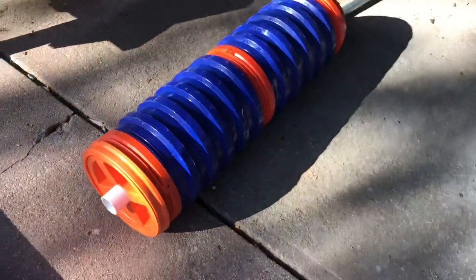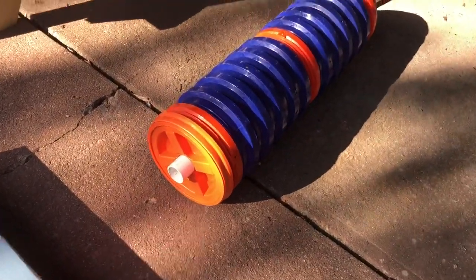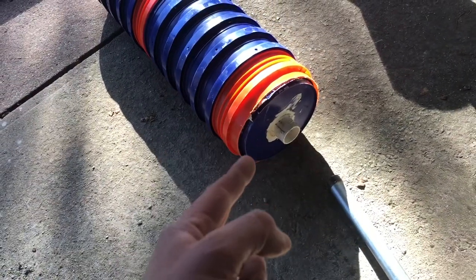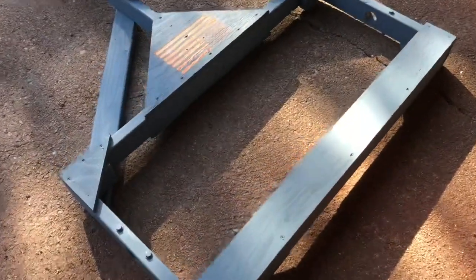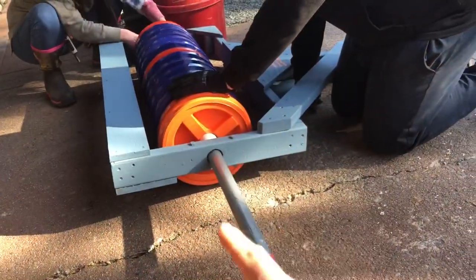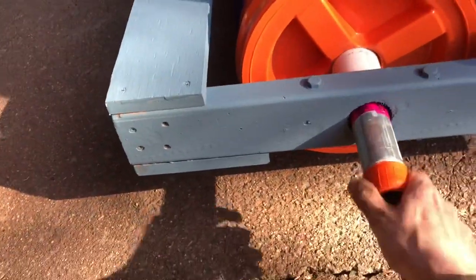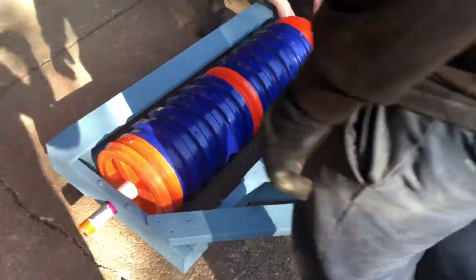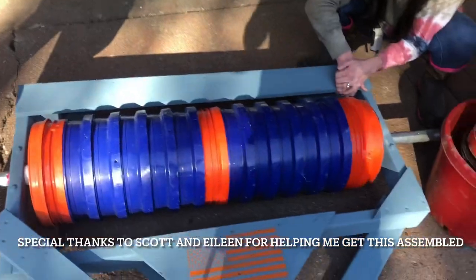Concrete is fully cured — I let it stand upright for two weeks. It's completely solid, sealed with the lid on the top end and siliconed on the bottom. All the buckets are one solid giant unit full of concrete. Now we load the roller into the frame, feed the galvanized steel axle pipe through the frame holes and through the PVC bearing inside the roller. The implement is seated in the frame. I'll cut the excess pipe and install cotter pins to keep the axle from walking out.